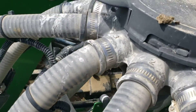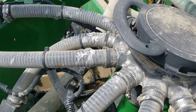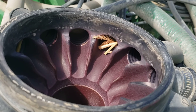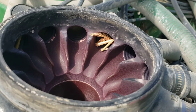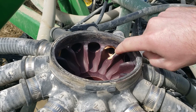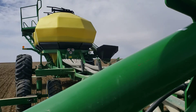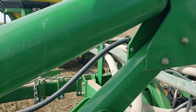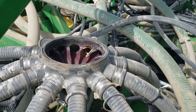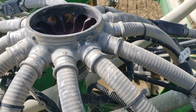Let's see what the issue is here. Take our tower cap off. Look right there — we got a bunch of straw right in there. These things should be cleared and it's not. The problem is our triticale seed wasn't clean. We had a bunch of garbage in there. And that's why it's important to clean your seed, because it can cause all sorts of issues.